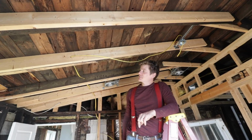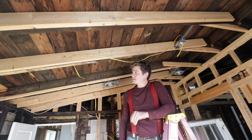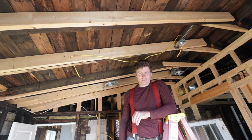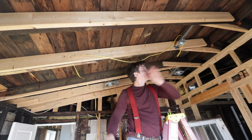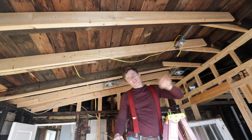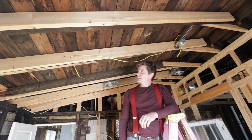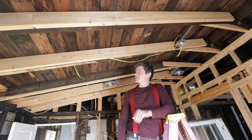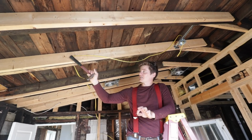As most of you figured, the advice I gave in the last video about wire staples was total hogwash. So I want to straighten it out by saying, when you come through a hole, or you come close to this bracket, or one of your work boxes for switches, receptacles, lights, whatever you're installing, you want to have one of these fairly close to that. I think the code is 2 inches, but you know, I don't know. They're flexible on this kind of stuff.